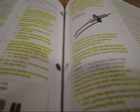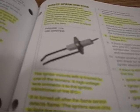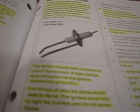They had all kinds of great stuff to read on direct spark ignition, and actually had to troubleshoot them. No longer is there a 30-second warm-up period with the hot surface igniter — the spark arcing between the igniter points directly lights the main burners. The igniter electrodes are fixed position; there's no need to adjust them in the field. To test the direct spark igniter, you cut a two-foot piece of thermostat wire, take off about a half-inch of insulation on each side, and mount one side to the furnace — take it to ground, mount it under a screw.